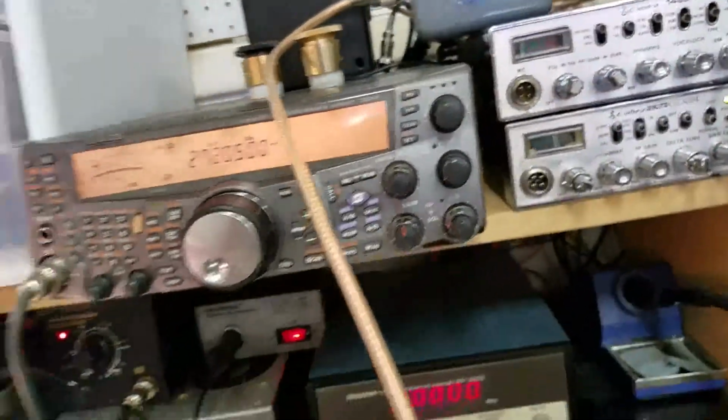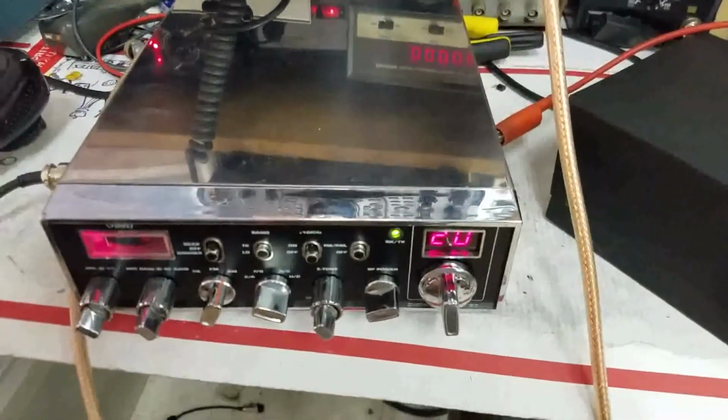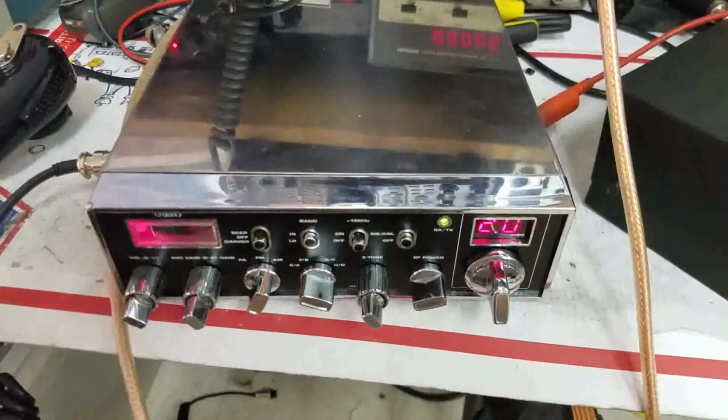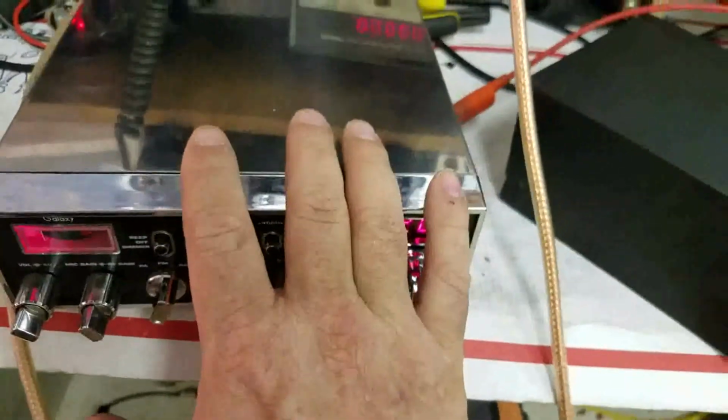Oh my God, it ain't hardly moving, but listen to that. Now, I promise you, you take this radio, you put it in a vehicle, you go two or three blocks down the road, it's going to sound just like that. On a good clear day, you get a mile down the road, it's going to sound just like that. Now, when I preach 4-to-1, that's with a 1 kilohertz tone going into the radio when I tune the radio. That has nothing to do with voices.